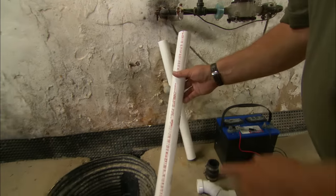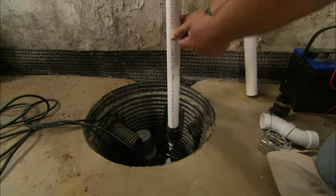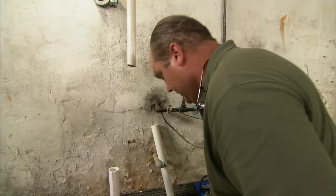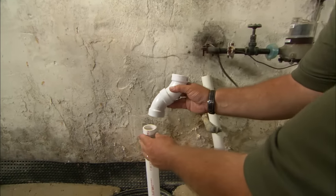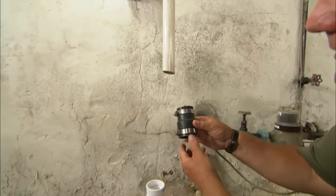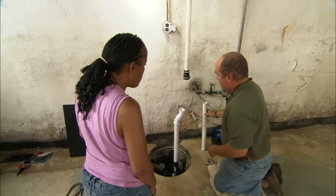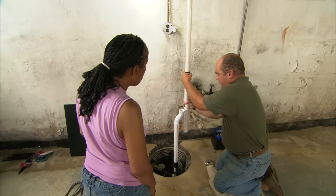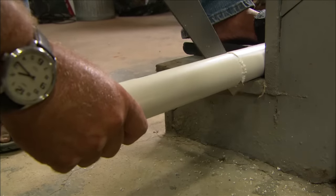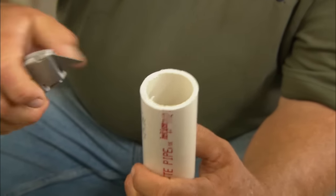For the connection on the discharge side of our pump we're going to use this inch-and-a-half PVC pipe. The connection down here is going to use a hose clamp connector, but you can see that when this pipe comes up it doesn't quite line up with our old work right there - the pump is in a slightly different location than the old one. For that we're going to use a couple of 45-degree angle fittings, and that'll create an offset just about perfect. To make that nice straight pipe at the top we're going to use this - it's another hose clamp connector, but this goes from inch-and-a-quarter to our inch-and-a-half size. We'll put the piece of pipe in and make our mark right here like a pro. Anytime you make a cut like this you can see there's a little bit of a burr, so I like to actually clean those off.